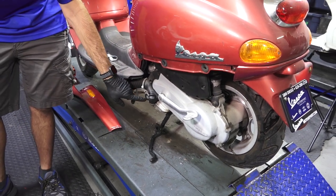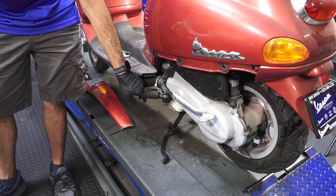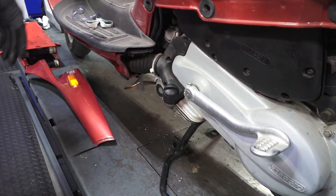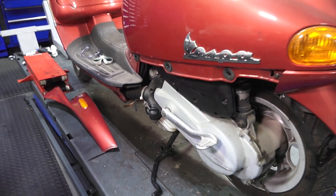I could tell you that it's not good. In that sight glass, this is a good visual indication. You see that fog in there? That's actually moisture evaporating away now that the motor got hot for the first time in 15 years because I ran it for a while. So I definitely do not want to run it any further on this oil. We're going to drop the oil.